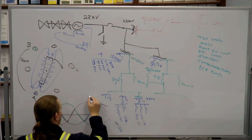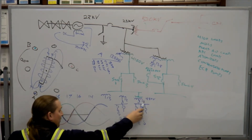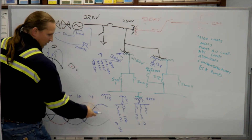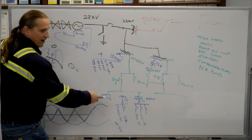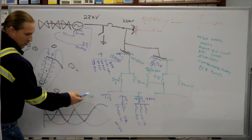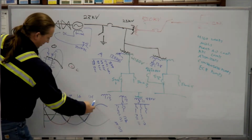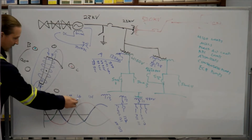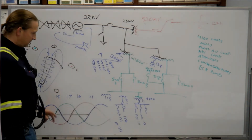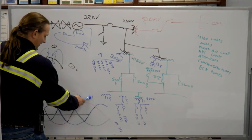Transformer locations: 13 is in the boiler, 14, 16, 17, 18. Transformers 11 and 12 are in the turbine building. Transformer 13 is in the boiler — you've got an MCC on the 4th floor and one up on the turbine on the 12th floor, so you have 131 and 132, and 231 and 232 on the south side. Transformer 14 goes to 141, 142, and 143 out at AQCS — 143 is up in the penthouse. We're missing 15. Transformers 16 and 17 are at the cooling tower and 18 is at river water. Switchgear 1 feeds transformers 11 through 18.